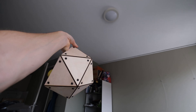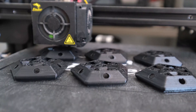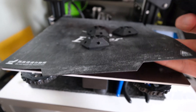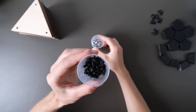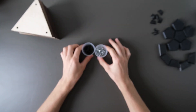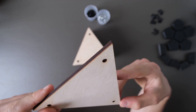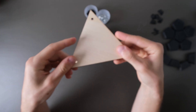Let's start off with 3D printing the pieces. There's no support material needed and they don't take long. You will need some M5 bolts that are as long as your triangles are thick plus six millimeters, and then some nuts — I chose self-locking ones, but I'm not sure if it's that relevant. I laser cut my four millimeter plywood at my university, but you could also try different materials — maybe something transparent and make a lampshade out of it.